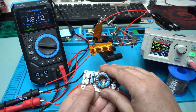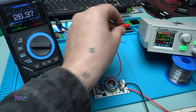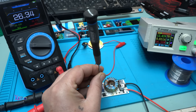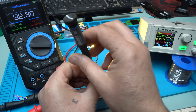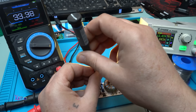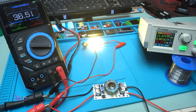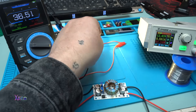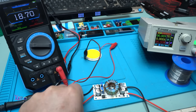Here I have a LED chip that works on 36 volts. Using this converter from 12 volts, I'm going to adjust it to 36 volts output. Wow, that is super bright! A little bit more - super bright! It's drawing 600 milliamps from the power supply with 36 volts on the output. It's working nicely, this DC-DC converter.